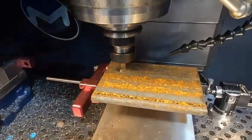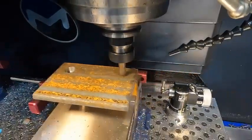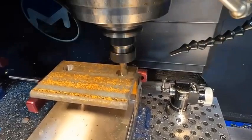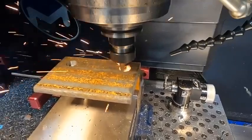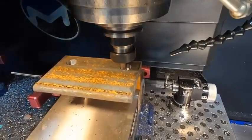You can clearly see as it's cutting to the bottom of that hole, it's really sparking out. I think that has to do with the material itself. That inside area of the angle iron is a little more shiny — it's almost like it's a little harder on the inside of the angle there, but there was sparking. Not good on the cutter.